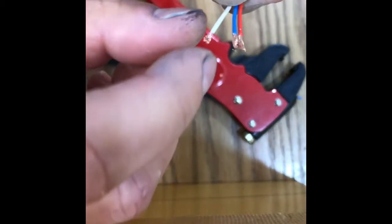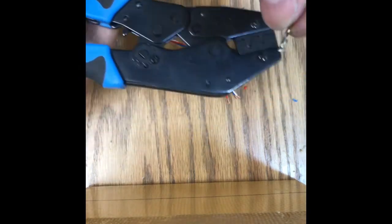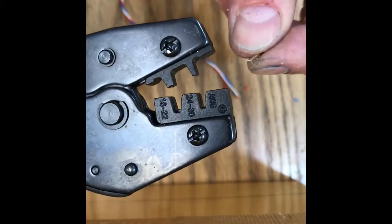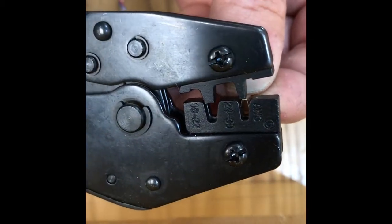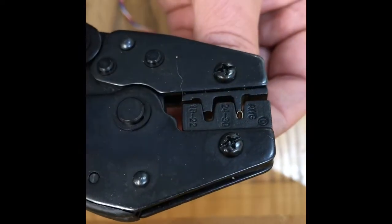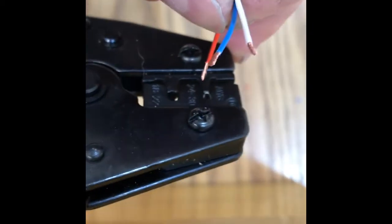Go ahead and twist each one of these up, then we're going to go ahead and put the pins on. So here's the pin, and we're going to need the crimper — you can get these through PowerBox as well. You can see it even says on here what size wire. What I like to do is take this pin and go through and put it this way into the jaws just so it's flush, and pull it forward just so you hear it click a couple times so that the pin goes to the top of the jaws and is flush right there. Then grab one of the wires.